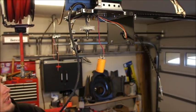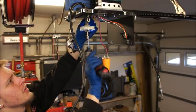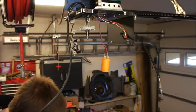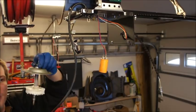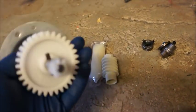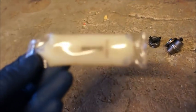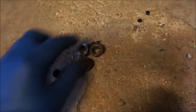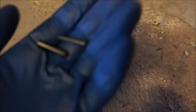There are also three more 5/16ths bolts that hold the sprocket to the chassis — one there, one there, and one there. That pulls out through the top and the sprocket's out. Now that it's down on the ground, you can see what they give you in the new kit: your new gear and sprocket assembly, a new limit gear, a new worm gear, a packet of grease, and all the smaller components in a bag. The only parts I don't replace are the roll pins — it's time consuming and unless you've got a bent one, which I've never seen, don't bother. But replace all your motor bearings.